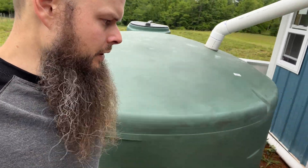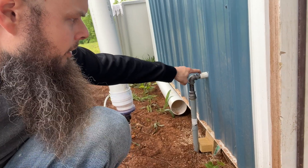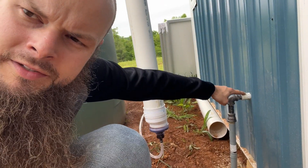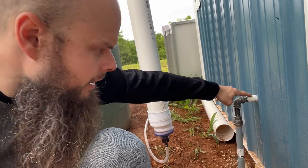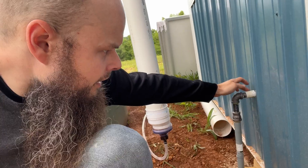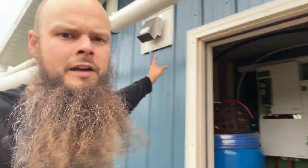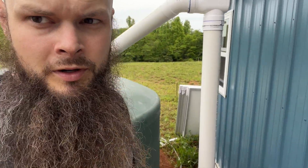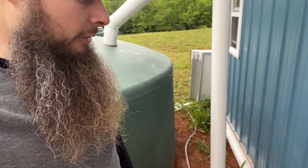Then, way over here, this goes down to half-inch, goes through the wall, and this one-inch piece of PEX perfectly accommodates the outside diameter of a half-inch threaded iron pipe. I'm using this as a sleeve because the metal has an abrasive edge. Instead of doing the crazy trim technique I did for all the other penetrations, I opted to just drill a hole since the pipe is circular anyway, and I can use some big stretch sealant to seal out the rest of that hole.